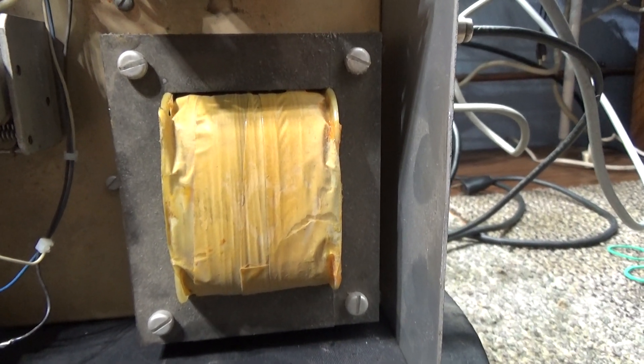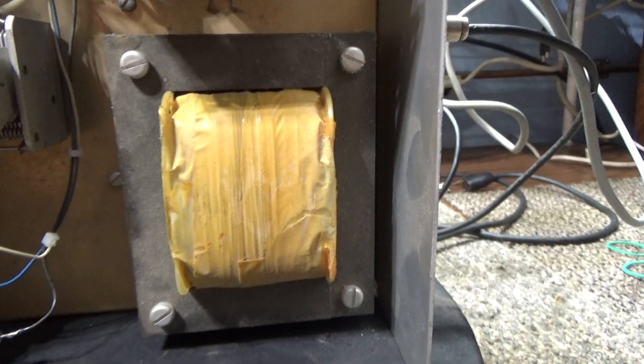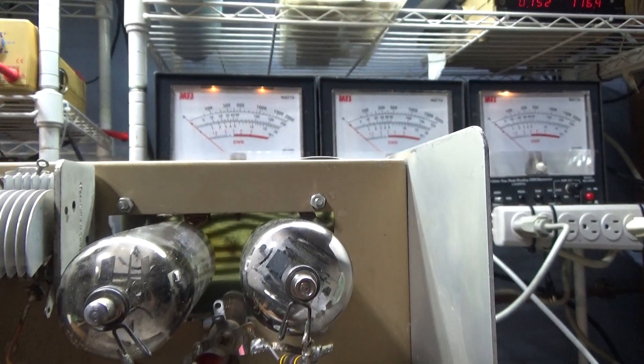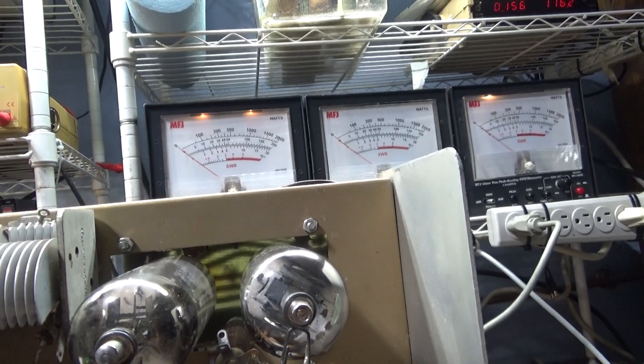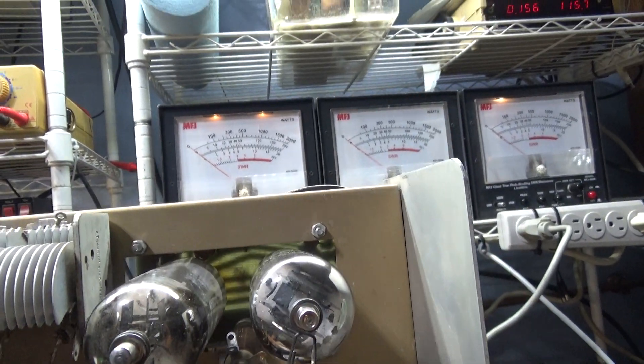Never over-fuse amplifiers. Usually when you do, sooner or later you're going to blow the power transformer. Thank goodness he didn't blow it, because the transformer, when that's gone, costs almost half as much as the amp between that and tubes. He flattened the tubes, so we put in replacement tubes — we didn't have 6LF6s, we had 6KD6s, but anyway, it's got replacement tubes in there.